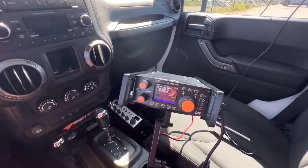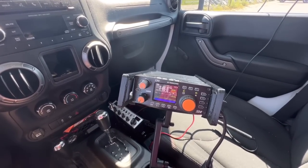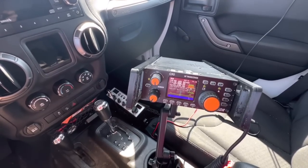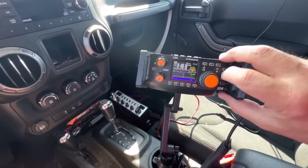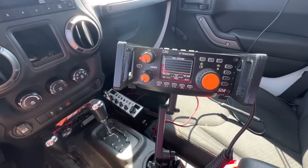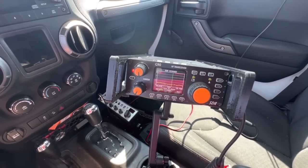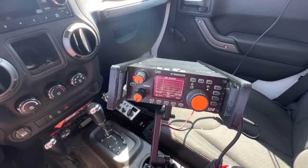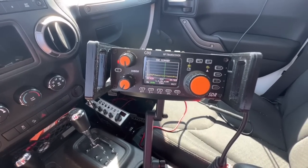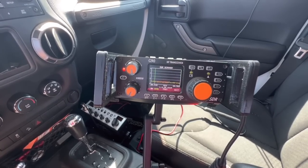Here inside the Jeep, the G90. One thing I didn't mention: this thing is exactly 5/8 of a wavelength for the 10-meter band. I don't know if 10 meters is open today — it doesn't look like it is — but that is a big bonus. Let's check some SWR right off the bat. That's 1.4 — pretty damn good SWR right off the bat with a 4-to-1 and that wire at 20.5 for 10 meters. I have a feeling this is going to be the winner. It's really going to be awesome on 10 meters.